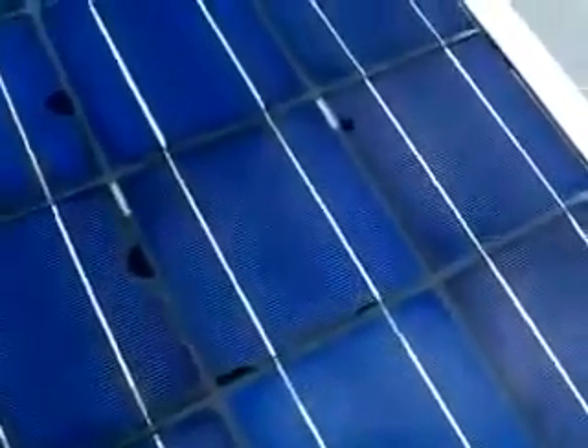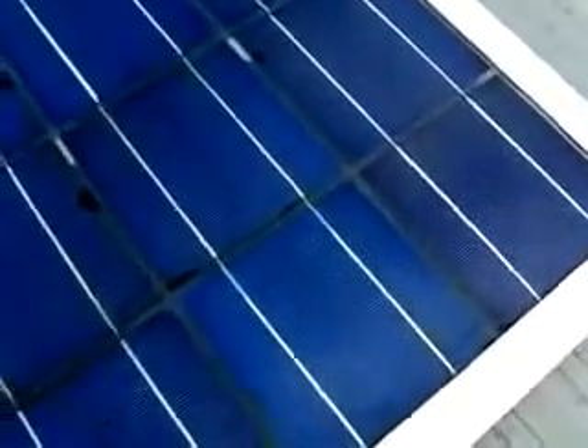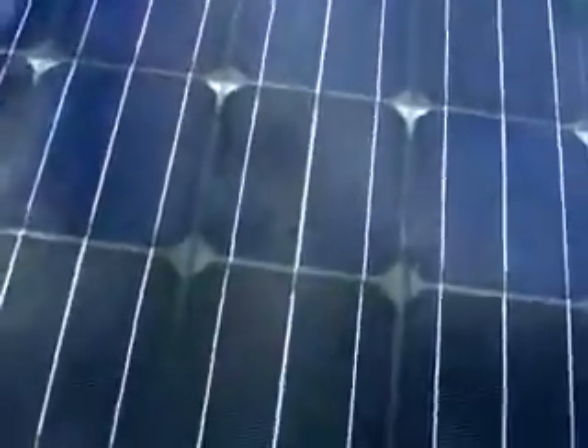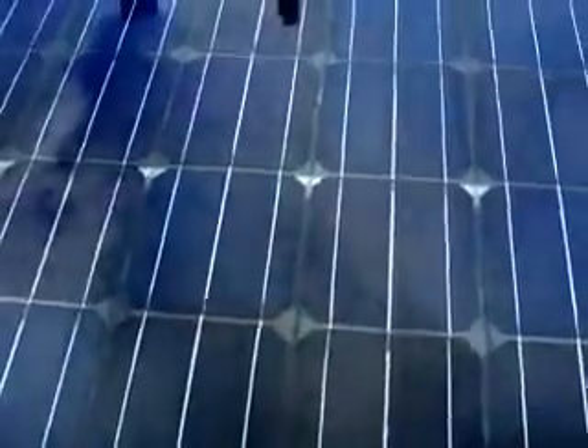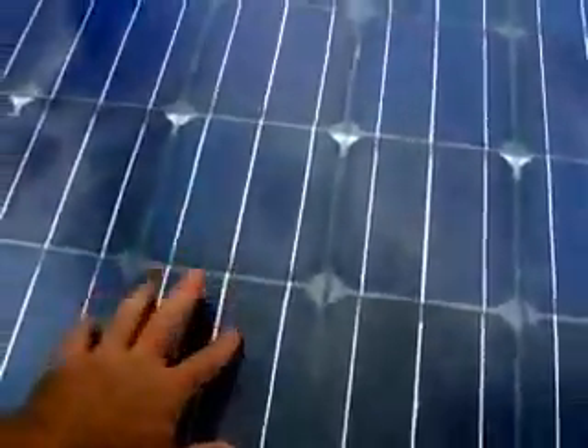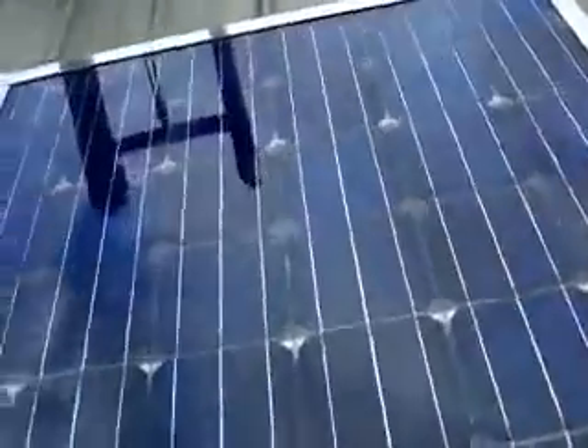These six by six cells are your best bet. The square ones - they're polycrystalline, not monocrystalline. That's what you want to get. They put out the best. I've tested a few of these mono cells here. This panel puts out almost a full amp less - there are 36 cells in it. In the same price range, the square polys put out about a full amp more.